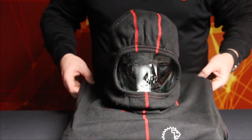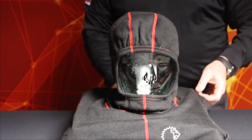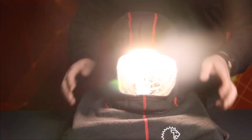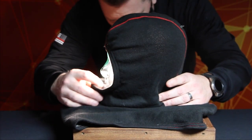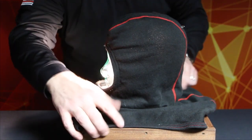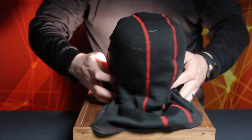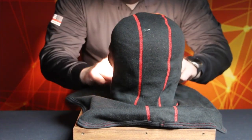To perform the evaluation, don the hood on the headform. Turn on the light inside the headform. Evaluate areas of the hood that have a particulate blocking layer in place, including the seams. If the light is brighter in some areas than in others, this is a sign of a possible defect or damage that compromises the hood's performance.